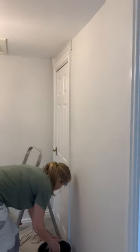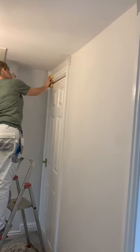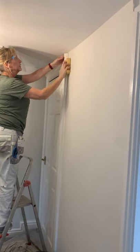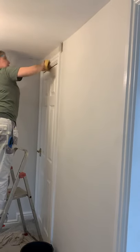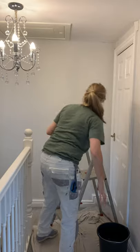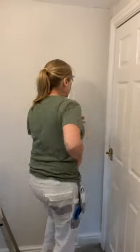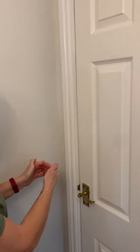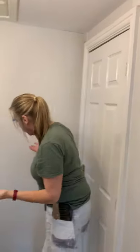Last thing — always always always get your paste off. If you leave paste on a surface it'll just go yellow. If you try and paint your door frame and it's got paste all over it, it'll go a bit gungy. So nice and clean, and those two bits can just stay like that. That is lining paper into an internal corner — the corner is protected now. So we've gone round the corner, left two bits at the top, cut to angles, done cross-lining to the bottom, trimmed off excess, and done the external corner. That's your demo done.